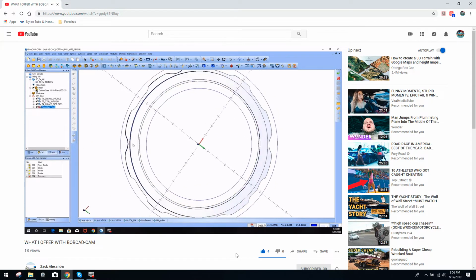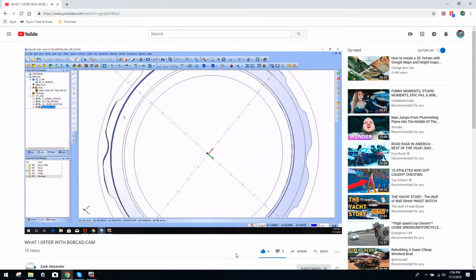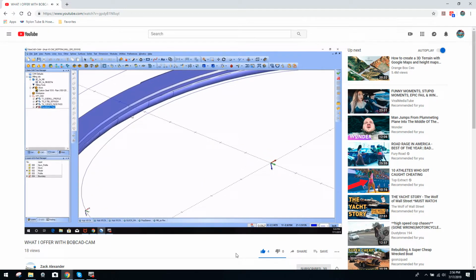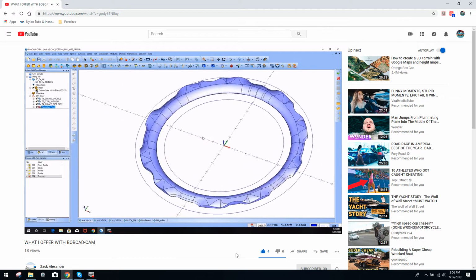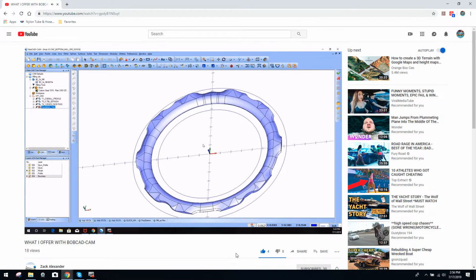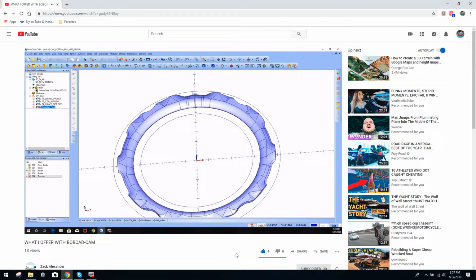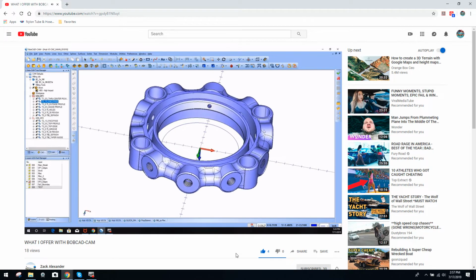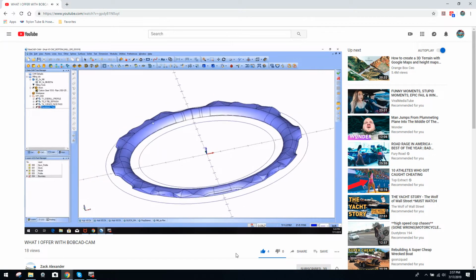This one, we had a lathe op where we did the lathe work from this side to basically turn that step, this surface, and then through here. We left a little bit of meat on this diameter right here, and then on the outside, of course. I don't know exactly how we ended up holding this down. Never got any feedback about it. I guess it worked. Maybe even taped it down. And then we did all of this on the mill, all the surfacing work, kind of similar to all of this, which goes on this part, so it's got to blend in. So all the surfacing work was done on the mill on this op.